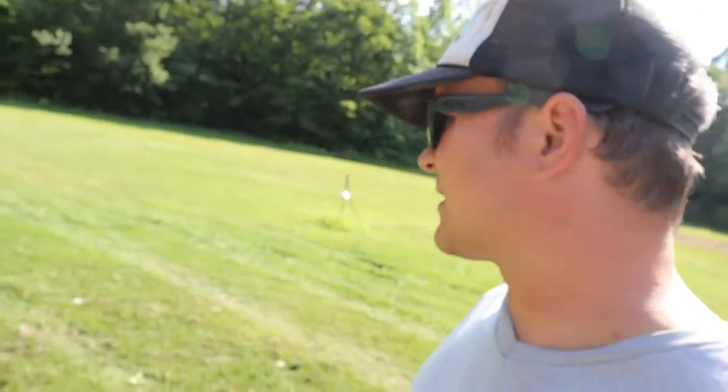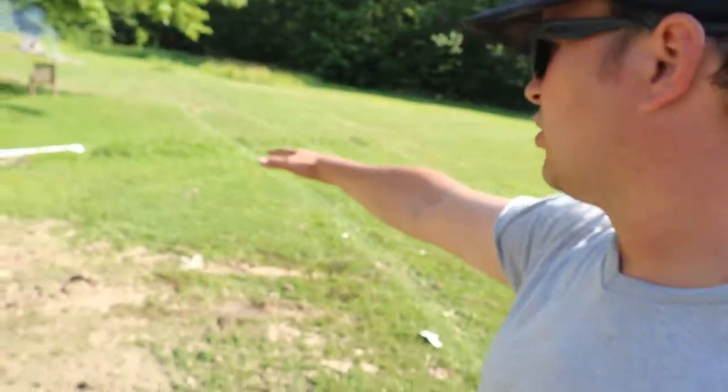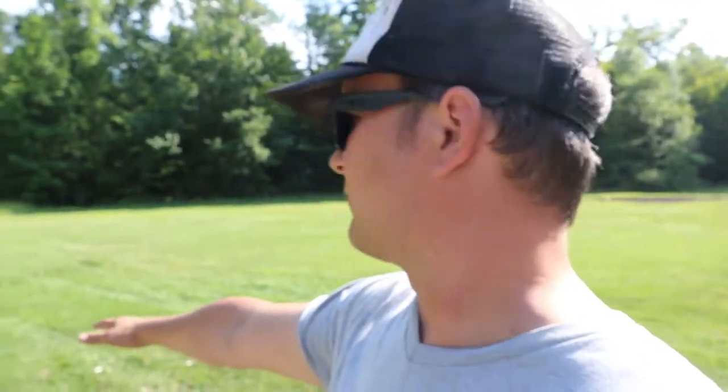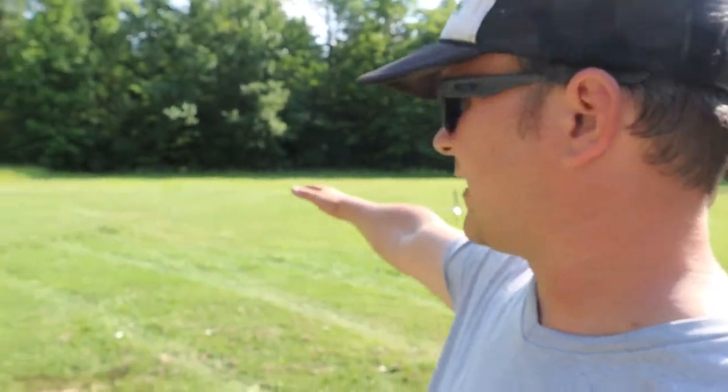So here we are, all backfilled. But the plan is later this evening to till this, because this right here is not level at all. This is higher than the house, and we're like 20 feet from the house. So I'm gonna rototill this and then kind of back drag it and put it all over here, kind of mound it a little bit, because that's gonna settle some more. And maybe reseed it, maybe not reseed it, I don't know yet. But yeah, what a project.